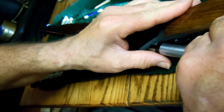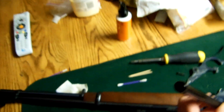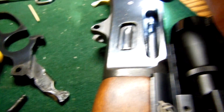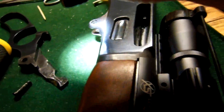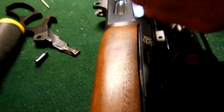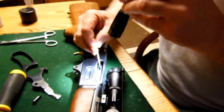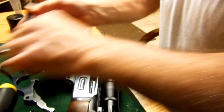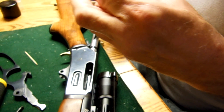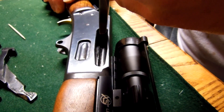It's not easy. Got it partially in. Now I'm going to look in here and make sure that spring is lined up in the groove with the bolt. I can actually look inside there and see. I am misaligned — I rotate the bolt so that that groove slides over this spring. Now I'm up against it, starting in with that spring. What helps an awful lot is if you push down and back on that spring right there, and then try to get the bolt forward.